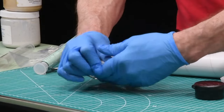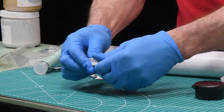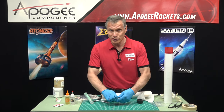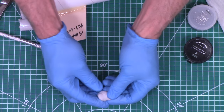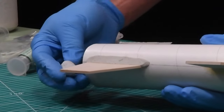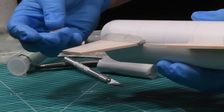Once you get a uniform color, you know the epoxy is thoroughly mixed. With the Bond Aid, you'll also feel the chemical reaction — it will start to get warm. Once it starts getting warm, you've got to work really quick because it's going to get hard very fast. The nice thing is you can sculpt or shape it to anything you want. Here's a fillet of the Bond Aid and it's rock hard — it has an edge to it, a little lip, because it doesn't feather out very nicely.